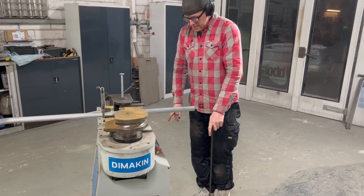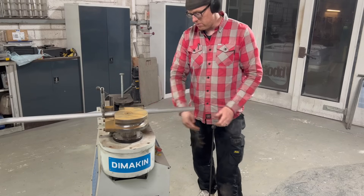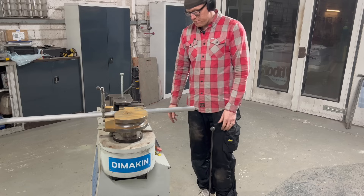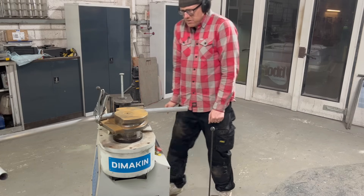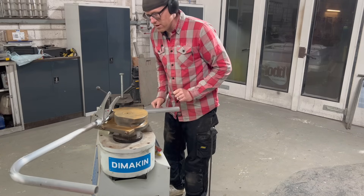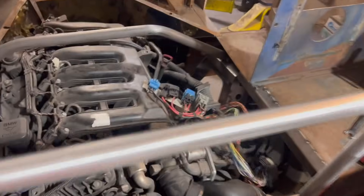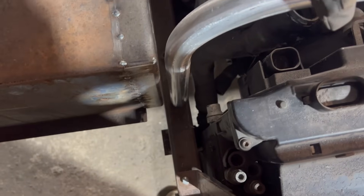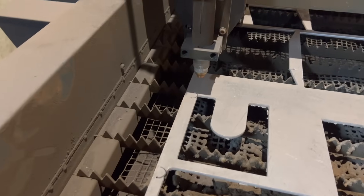That was just a scrap piece to try. Now I'm getting the actual stock and bending up my hoop. I've reset for the second bend and taken the angle finder off in case it fouls as the material pulls through. Hoping that 92 degrees — just a two-degree springback — should be right. Don't snap, don't snap, don't snap... moment of truth. Oh yeah, look at that — bang on! Okay, 5mm aluminium loaded on the table — let's see what we've got.